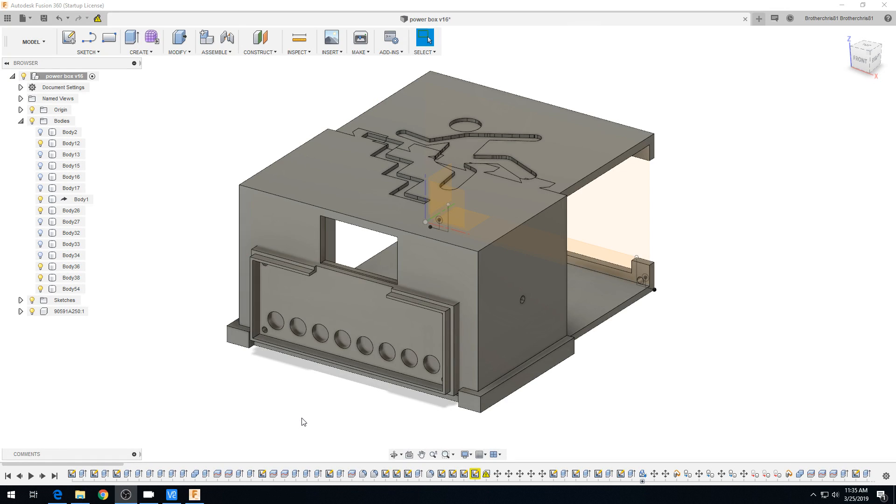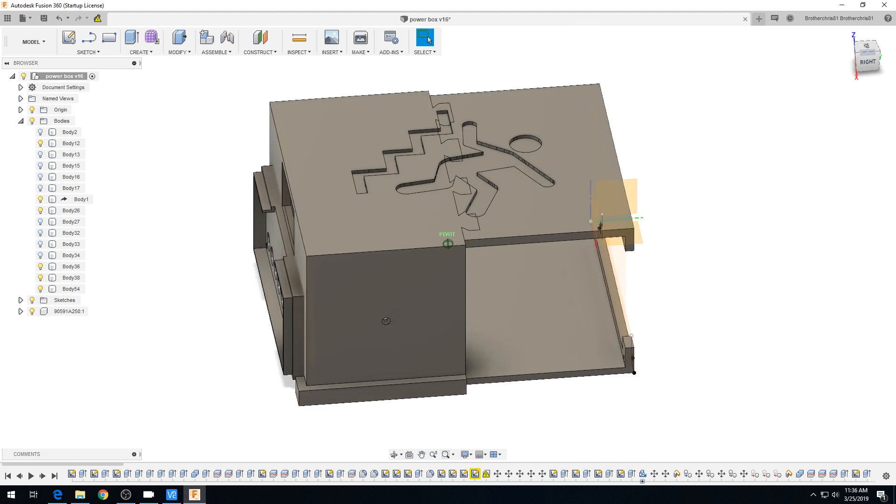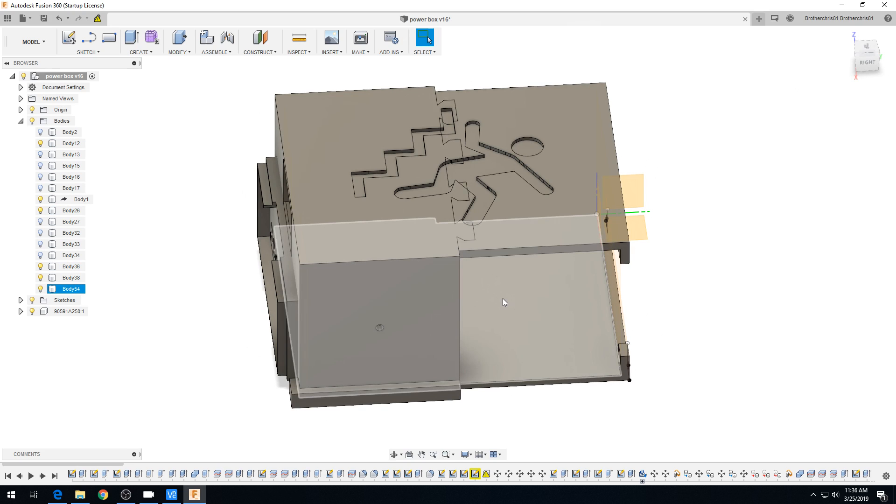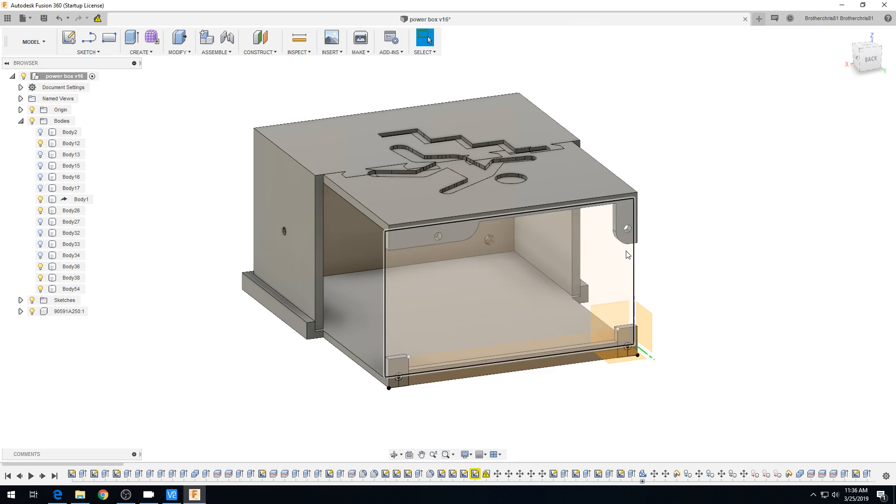So here's what the box generally looks like. The breakout board will go in this spot here and we can snake the ATX plug through this hole — it plugs in the top. This front plate section can actually be screwed down to the front of the box so it's easier to print. It all comes apart. The front of the box is actually keyed to the back top part of the box, again so it's easier to print. The power supply sets in here, and then the whole thing sets in a tray — this bottom tray piece. In the back, I've matched up all the screw holes so we can line those up and get it snugged down. I did add some screw holes in the front of the box just in case it's not quite solid enough — I could tap some holes and put some screws in there, but I think it would be okay even if we have to use just a little bit of glue on the front.